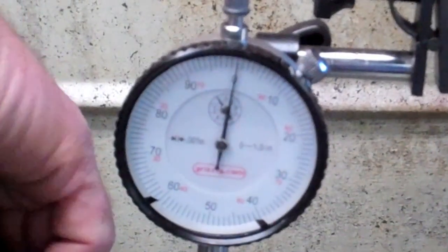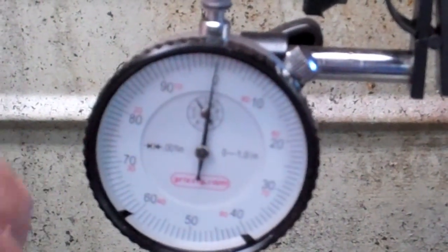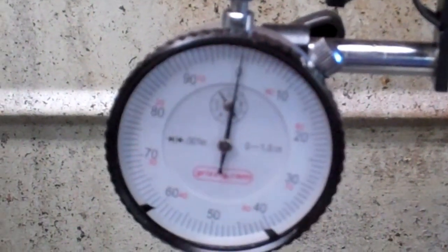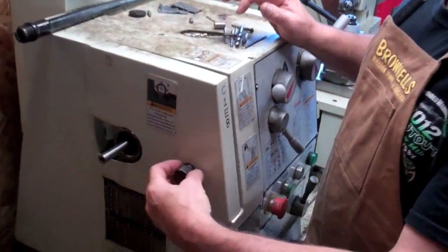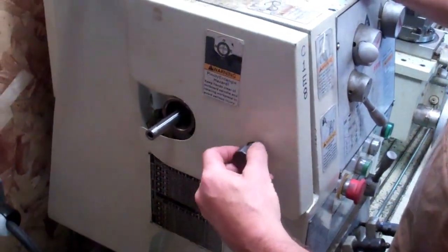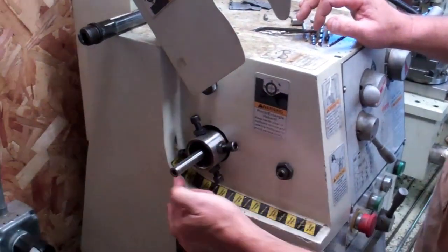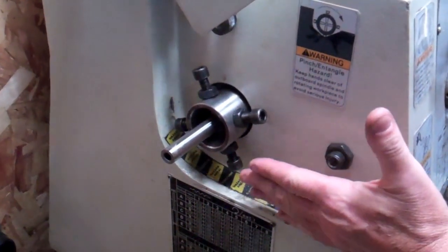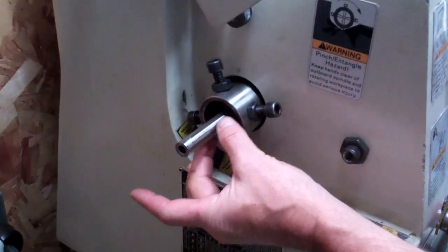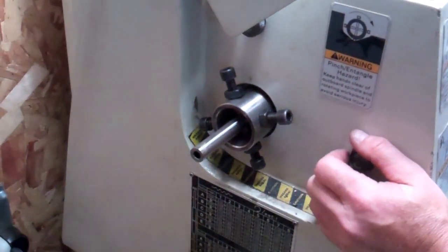If you look really carefully, you'll notice we're turning about a half of a thousandth. I'm going to show you what we do back here in the back part of the lathe. This is a gunsmithing lathe with a large spindle bore. What I've done is I've put these little bolts back here in place — these are called spiders. What that does is you put a dial indicator back here and you get all this nice and lined up so that the back part of your barrel is turning true also, just like the front.